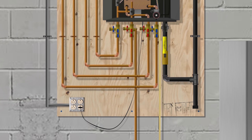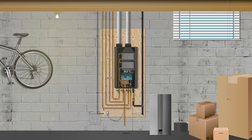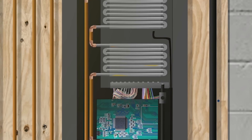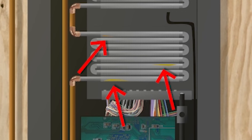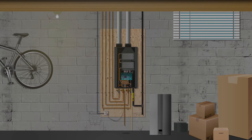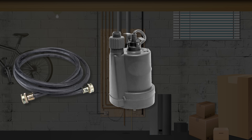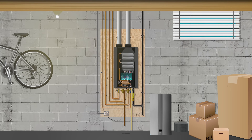To clean the water inlet filter, you'd use the isolation valves to close the water to the boiler and simply unscrew it with a pair of channel locks. If you see any debris, just use a toothbrush to remove it and put it back in. The third thing is to de-scale the exchangers. Your exchangers work really hard to give you that instant heat, and it's super important to keep them in pristine order on the inside, which means any calcium deposits in the system need to be removed. To do this, you'd need two washing machine hoses, a small sump pump, a few gallons of vinegar, and a bucket.